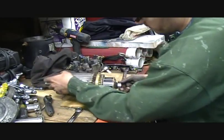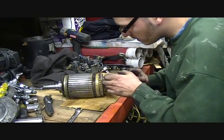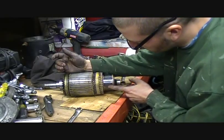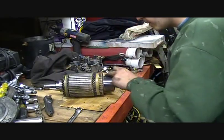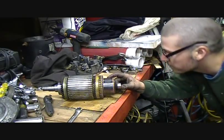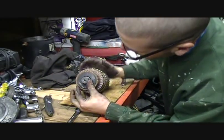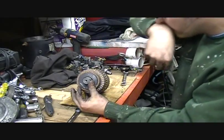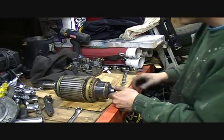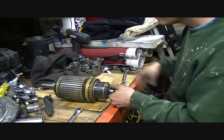This is what it's all about here — this is my commutator bar. I can feel just with my fingernail, it's rough. These commutator bars are pretty deep. I'll put it up so maybe you can see — they're fairly deep in here. So if I have the shop take a few thousandths off of here, or maybe even less, I should be good to go with this guy.